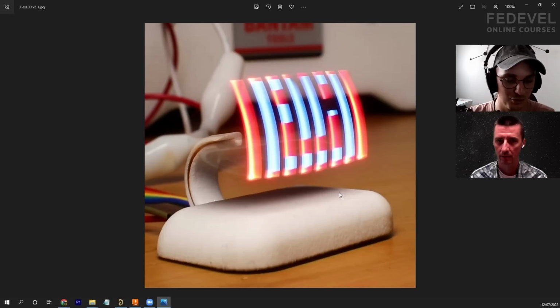Because I also went into analyzing the durability of the thermal aspects of the PCB. For example, for flexible PCBs, I found that the silk screen on the coils, if you heat it at 100 degrees after, I think it was around 1-2 weeks, will start to discolor a little. It will start turning into a yellowish color, and stuff like that.